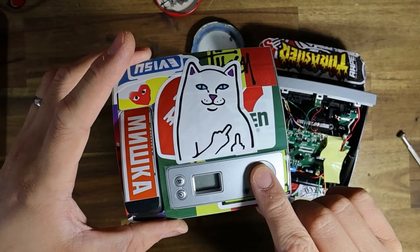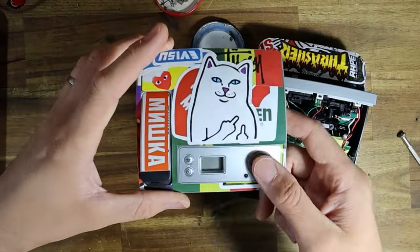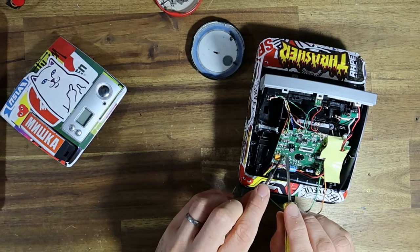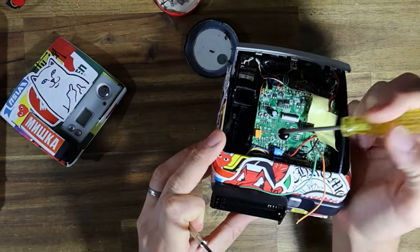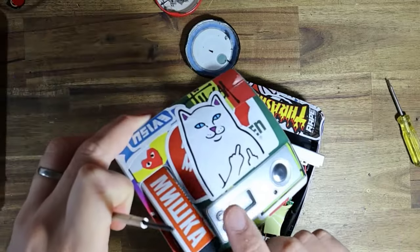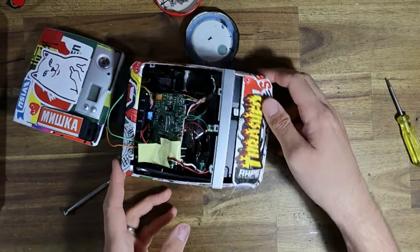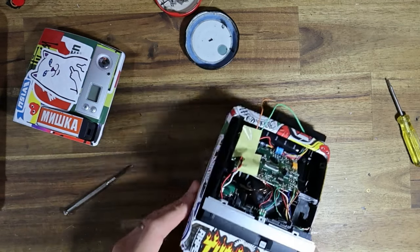You can half press it and then you can full press it. The half press will wake the camera up once it goes into standby. The full press will take a photo. So that means two switches need to be engaged. So if you actually use some kind of metal contact and short both of them, the camera will take a photo. And then the little pad to the top turns on and off the red eye reduction. So it's the same as the button on the top panel. Why they exist, I can only assume is for factory testing, because otherwise the camera works completely like normal.